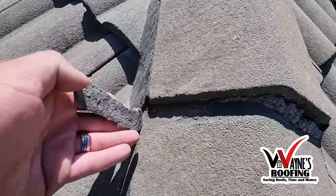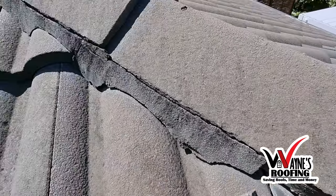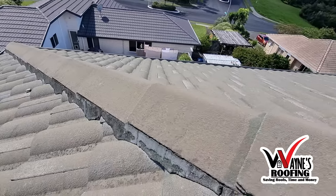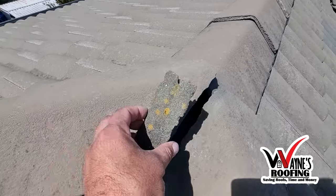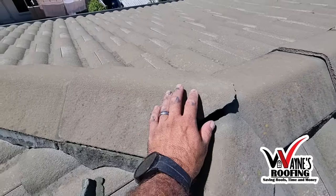These cracks can lead water to enter your home and cause damage and leaks to your property. Weathering over time can make this become brittle and crack. Older generation cement-based mortar was not flexible and caused it to crack. Movement in the roof can also cause this to crack.